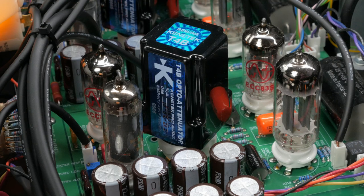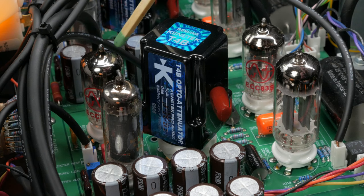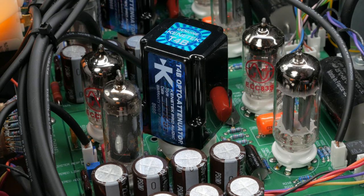Unlike the originals, the DLA-2A is both a stereo and dual mono compressor inside of a single unit. Stereo linking ensures that compression is being equally applied to both the left and right channels of your source material. Inside, nestled alongside the T4Bs, for each channel you'll find two 12AX7s. One amplifies the signal before hitting the 6AQ5, and the other is part of the sidechain gain reduction amplifier. The 6AQ5 provides the voltage necessary to drive the T4B and a 12BH7 output driver.